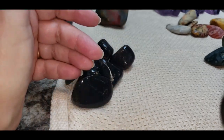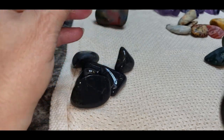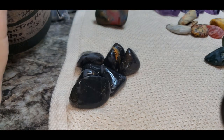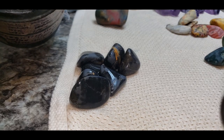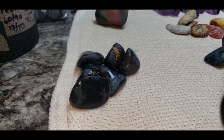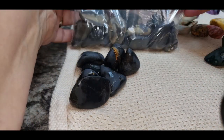We are getting zero mass loss. The grind is not happening. There's no ceramics in this barrel. There was some topaz in here that I was running as a substitute for ceramic, but there's hardly any in here to really make a difference. These are the only pieces I have that are ready for medium, so it's going to be a small batch to begin with.